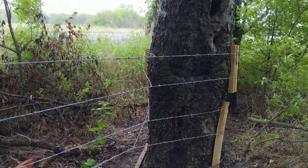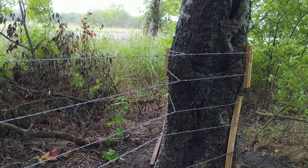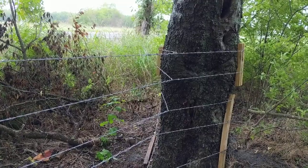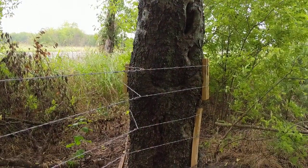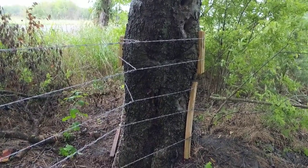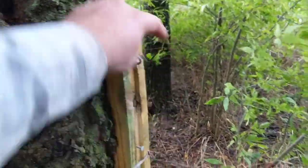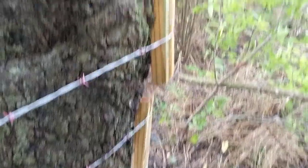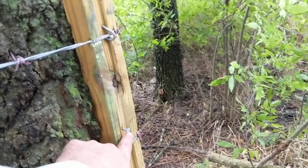On this corner there's a lot of debate out there on some forums about using trees as corner posts. I decided to use this massive hackberry right at the corner. What I did so that the tree doesn't eat the wire is I put these pieces of two-by-fours — I just put a nail through them and around the tree, so the wire comes through here.